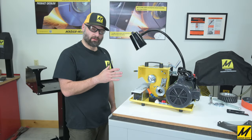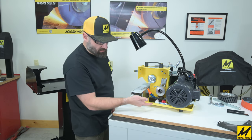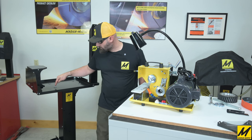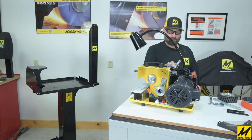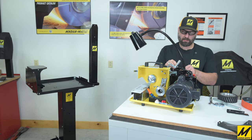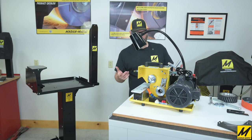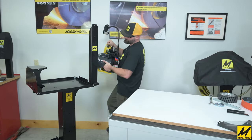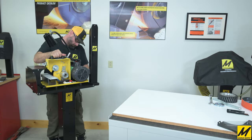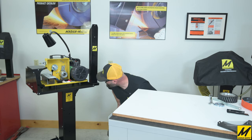Here's a quick recap with a closer view: the valve with the hose going underneath the motor, the connection to the bottom steel plate, and the adjustable nozzle for coolant flow. Now we're ready to place the sharpener onto the water tray. The rubber feet locate on top of the nuts that we caulked earlier. I recommend you tie up the cord and tuck it somewhere on top so you're not tripping over it. It's also not a bad idea to have someone give you a hand — the unit is about 90 pounds.